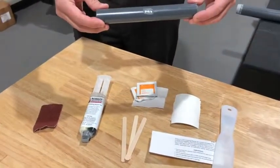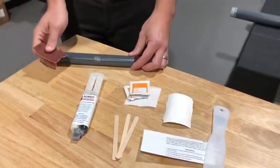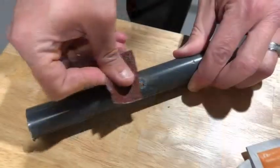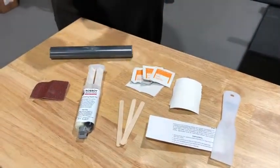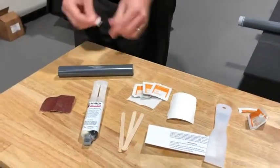To prepare the damaged surface of the coating, follow the enclosed instructions. First, use the emery cloth in order to prepare the surface of the damaged area, removing any debris and creating a good surface profile. Next, take a cleaning cloth to remove any excess debris and wipe the area dry with the enclosed dry cloth.